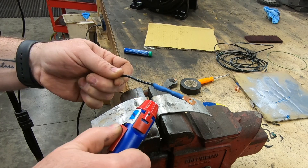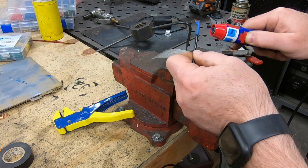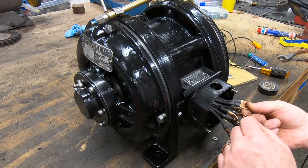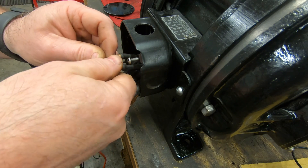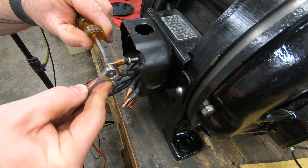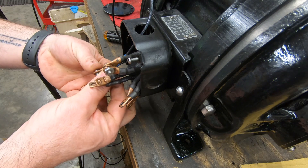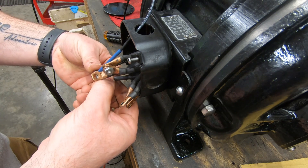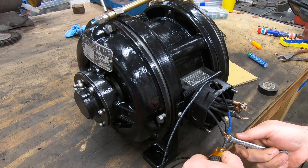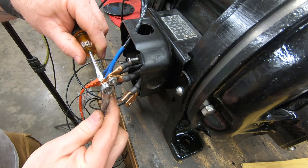To provide just a little bit more protection I am putting a small piece of heat shrink tubing on it as well. To make all of these connections it was originally with a small nut and a bolt, and I see no reason not to continue that practice. I know there are some folks that don't like using this method — I've even seen it where the terminals were cut off and replaced with wire nuts, and that to me makes absolutely no sense. This is a much more secure connection that will not come apart.